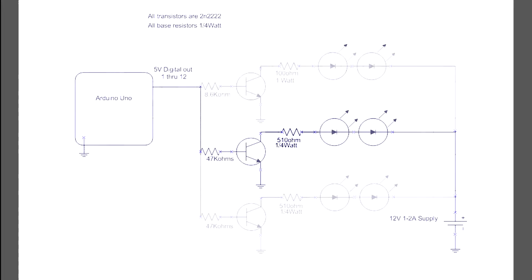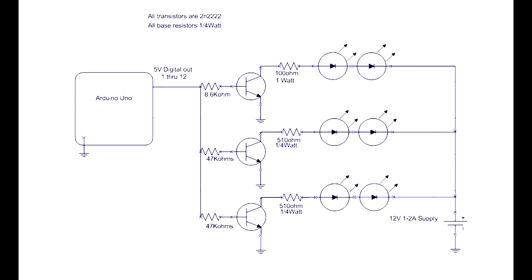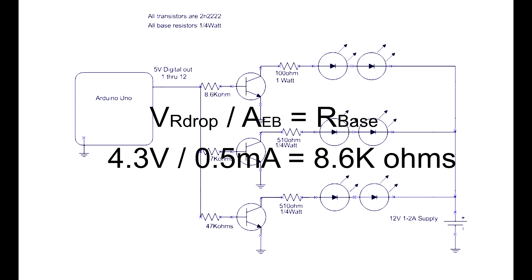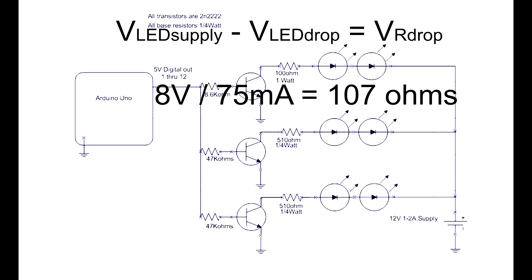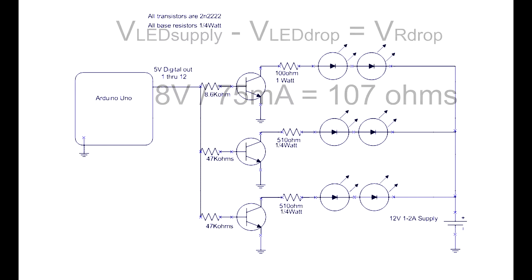As an added twist, I'm going to run three sets of 12x2 LEDs: two sets of 20 milliamp LEDs, and an extra set of 100 milliamp super bright LEDs. The bright LEDs will face the street — my front door is about 50 feet from the street, so I wanted these to stand out. For the 100 milliamp LEDs, I'll run about 0.5 milliamps at the base, which will require 4.3 volts over 0.5 milliamps, or 8.6k ohm resistors. For the LED side, I'll run the LEDs at around 75 milliamps. 8 volts over 0.075 equals 106.6 ohms, so I'm running 100 ohm 1-watt resistors for these. These LEDs have a 2 to 2.3-volt drop, so I'm still using the 4-volt drop for this calculation.